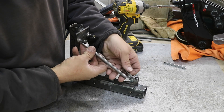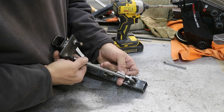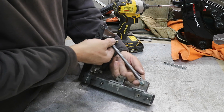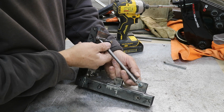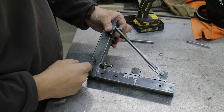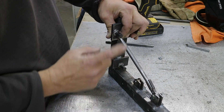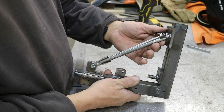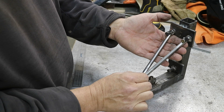This tube goes on here and comes down here. That angle's pretty good because it's parallel to the bearing mouth. The only thing left is there's a 45-degree bevel at the bottom of this bearing mount, and this still has a square end, so I'm going to put a 45 on this tube. I got a pretty good fit — this guy will fit in there. Now I'm going to make the other one. There are the two upper legs mounted. I've used a couple of super magnets to hold things in place — the fit's pretty good, they come together nicely. I'll tack these two tubes in place. I've turned it upside down because they'll lay nicely into the standoff, and I'll put a tack on each one.